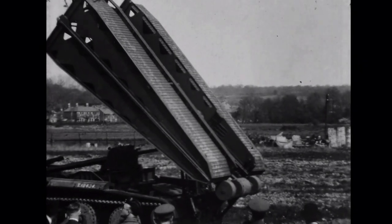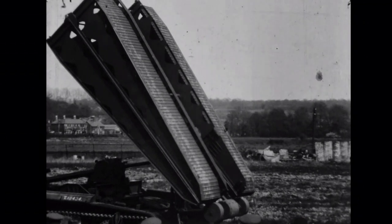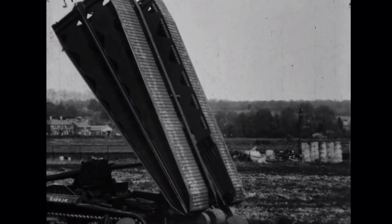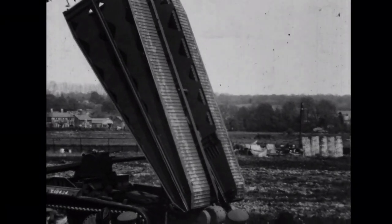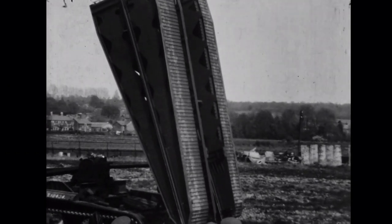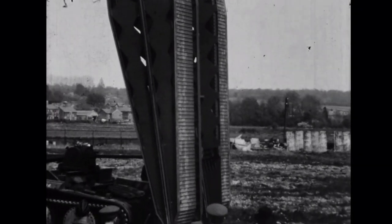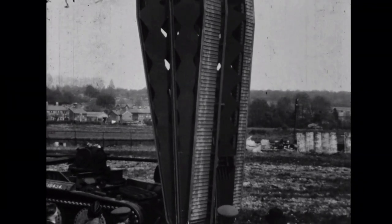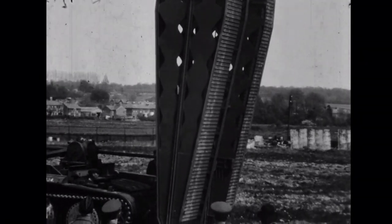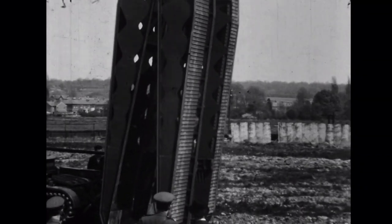In the foreground, we can see a group of civilians and officers gathered to watch the demonstration. The threaded rod at the rear runs between the length of the bridge. Power is transferred to the gearbox inside the tank's original turret ring, which transfers the power to a threaded rod that is then rotated. There are rollers at the front of the bridge, just out of shot, which touch the ground as the threaded rod continues to turn. The bridge deploys with cables inside the framework pulling the front half of the bridge outwards.